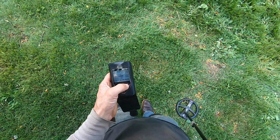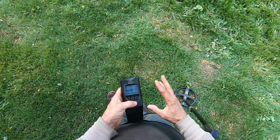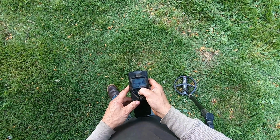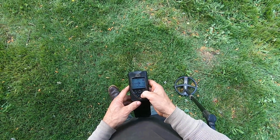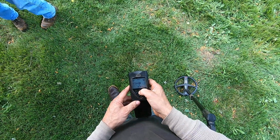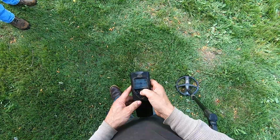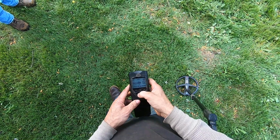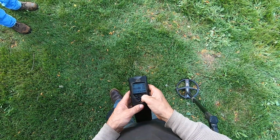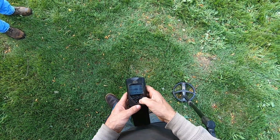Now change the frequencies. So when I change the frequencies, I have to make a few other adjustments on here, or it's going to be unstable, right? Go to 11.3 kilohertz, and I have to go down with. Actually, I can go up with my gain. Let me go up with my gain. See if I can crank it up here. 99.